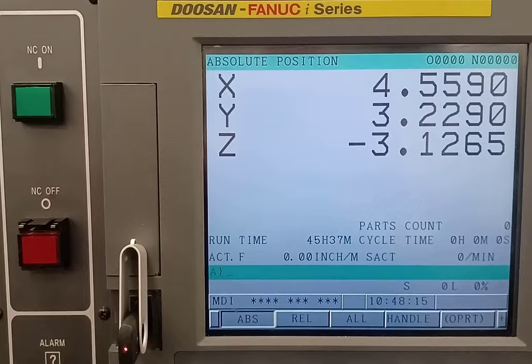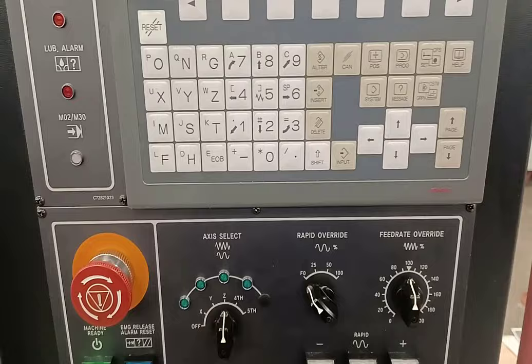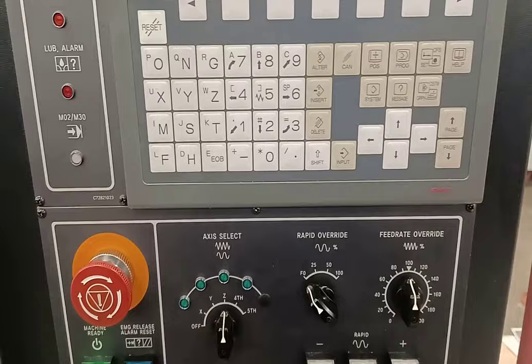Now I should simply be able to go into home return, go into my Z axis, and send the machine home. I usually like to go as slow as I can because if I'm already there I don't want to over-travel. I'll look at my home — I'll hit plus for Z, plus for Y.